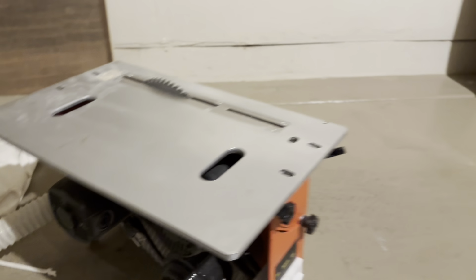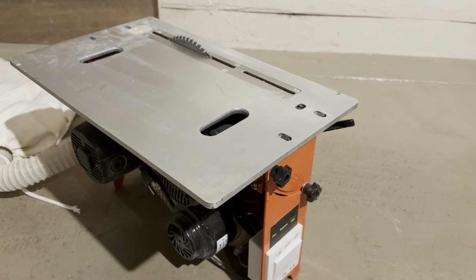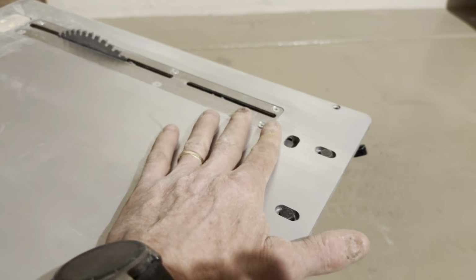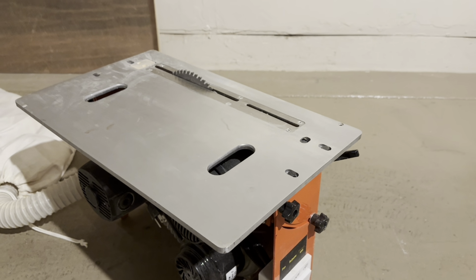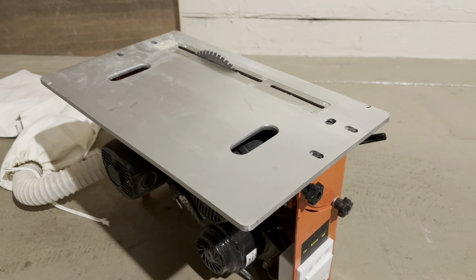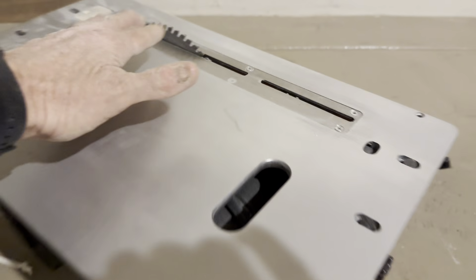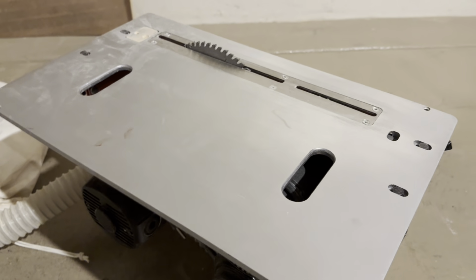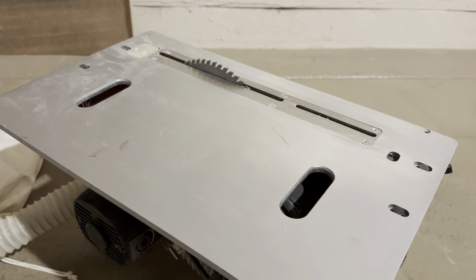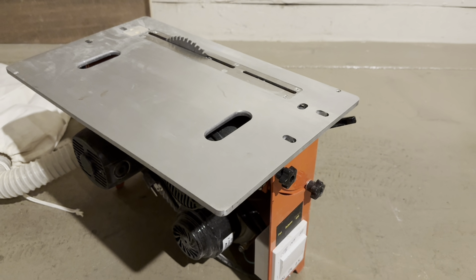Now, I will say that in using this thing for about 4 or 5 days on a cabinet installation, the rip quality was fantastic. Even with the factory original saw blade. I was using it for melamine materials, and I typically have my finished side facing up, which prevents scratches and so on, but the rip quality was excellent. Now, that's an 80 tooth saw blade, which I'll make a note to include the millimeter size, but I thought I would be able to use an 8 or 8.5 inch saw blade that I could get at a local big box store.